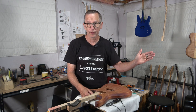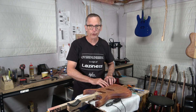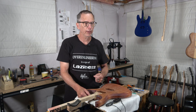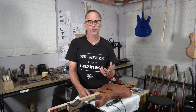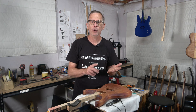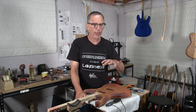You can do all of this long before you ever build the guitar. The other components that have an effect on tone are the electronic controls — specifically the potentiometer, and most importantly, the capacitor that is soldered to the tone potentiometer. This is an issue a lot of guitar builders struggle with because they often have experience with guitars where you turn the tone knob and nothing seems to happen. That's typically because the wrong capacitor was used.